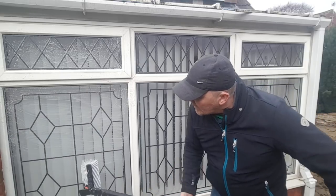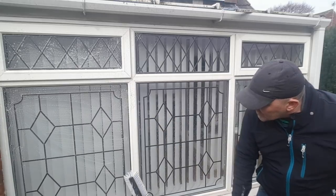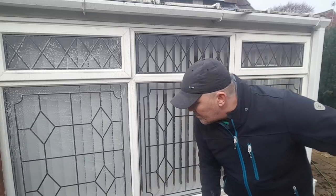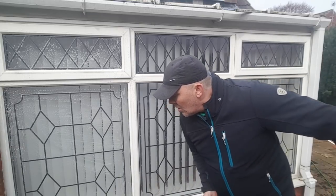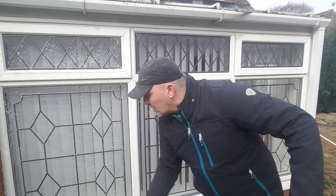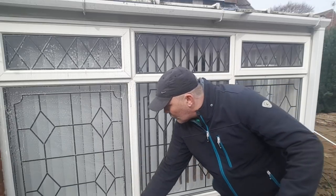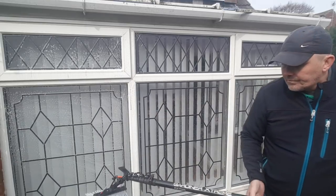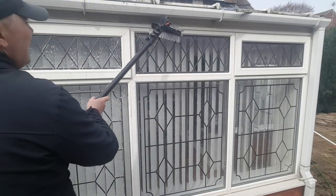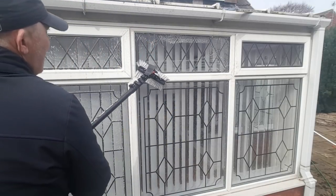As you can see, we're putting it onto a wet surface. The reason behind that: if you put it on a dry surface and let it dry out, you will get staining. Not with Nubix, but with things like Virasol or Autoglym — some of their products I've seen leave staining on the PVC. Even if you use sodium hypochlorite, as the lads call it on the forums, you will see it turn orange if you leave it on there too long. Nubix — I've never seen it stain PVC regardless of the strength we use it at.